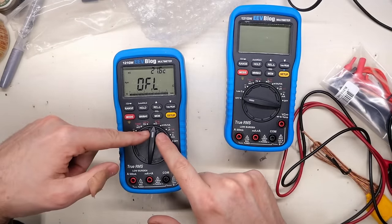I alluded to this problem of having test equipment that doesn't always work properly when I was trying to repair that Tektronix scope. I think there was a main channel video recently. Same thing. That scope would often work, and then sometimes you would switch modes or something, and you would get really weird readings because there was something wrong with the attenuator module, some kind of corrosion or oxidation in there. And that means I could never use that thing, not without completely replacing those attenuators, because it's gotta work 100%. My oscilloscope and my multimeter just need to work all the time, as they're designed to work.